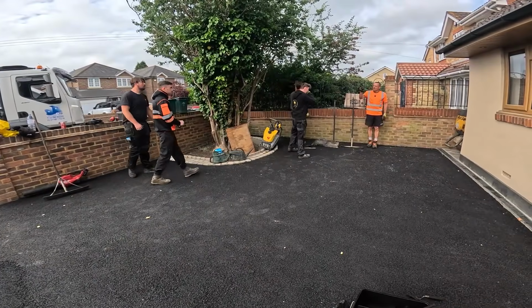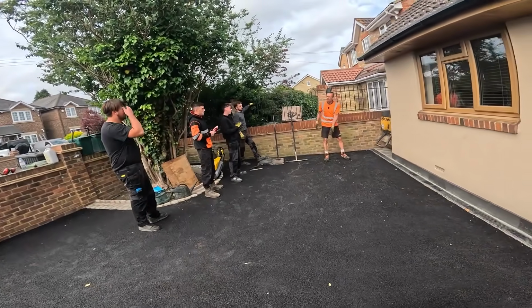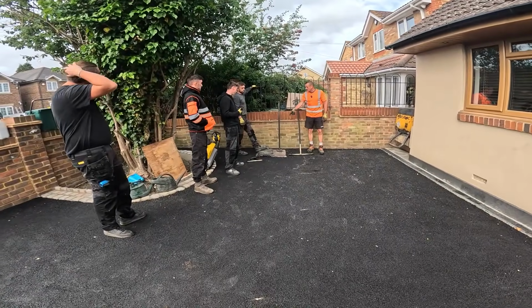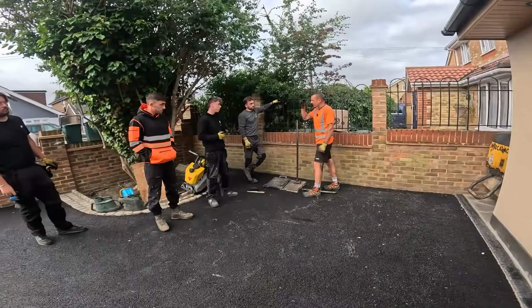Right, you're going on the roller, get that roller wet, but keep the water minimum. I don't want it flooding, because then it gets one edge cold and then we get that line. It's a little bit of water. You're going on the trowel. As soon as I've gone down there, start pumping. Just check the temperature as well though. Start pumping, because we're only going 30 mil, yeah?